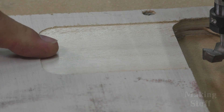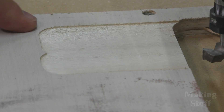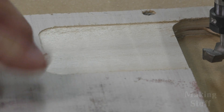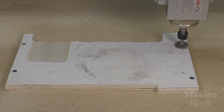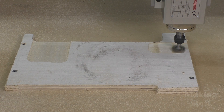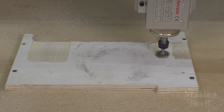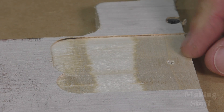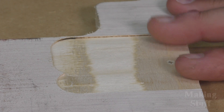I don't think I could have done any better than this on the first try. There are absolutely no lines or staircasing going on. There's a little fuzziness here which I think was because I was running the spindle too slow. I'm going to reset this test to check front to back and see if that's as good as left to right. And the front-to-back test looks just as good as left to right. I was really thinking I'd have to do some fine adjusting, but it looks like I nailed it on the first try.